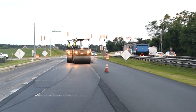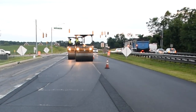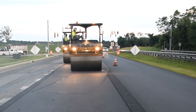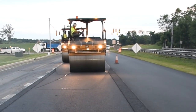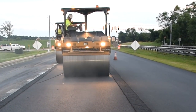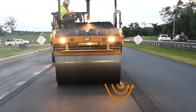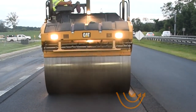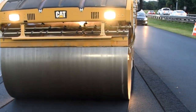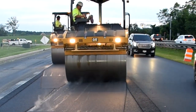Let's take a look from another perspective. The marks on the mat indicate the rollers have been operating optimally, compacting the asphalt using the Maryland method. As the rollers return towards the paver, the one on the left overhangs the unconfined material, and the one on the right locks and compacts the asphalt pavement. At the drum's right edge, energy waves force material towards the joint, creating additional density. As the rollers reverse direction, they compact the mat and excess materials into the joint, optimizing the pavement's serviceable life.